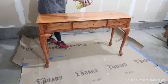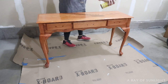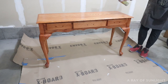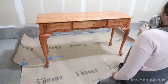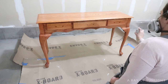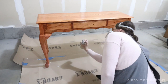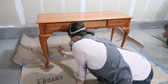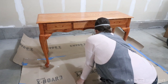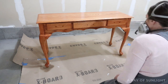First and foremost, I use clear shellac to prevent bleed-through. If you've never painted wood before, you probably have no idea what bleed-through is, but let me tell you, it is a big pain. Basically, bleed-through is when wood tannins or the dye in the stain bleed through your paint, so it looks like orange or pink splotches in your paint job — and no matter how many coats of paint you put over it, it won't go away. Shellac is one of the only things that will actually block bleed-through. You can get shellac primer tinted white, but I love to use the clear shellac so I can distress the paint a little. I also like the spray can instead of brushing it on, because it goes so much faster. Sometimes I joke that the piece looks exactly the same at this point, because the shellac creates a bit of a shiny finish, but I promise the shellac actually helps the paint stick better, even though it looks shiny again.